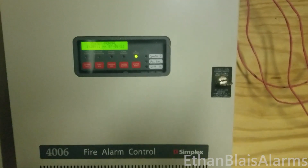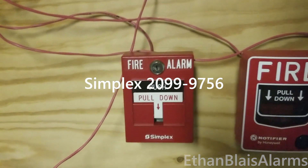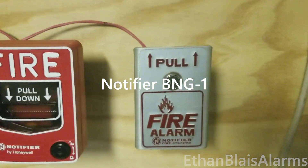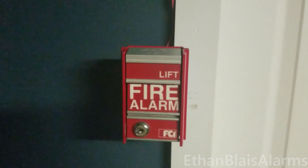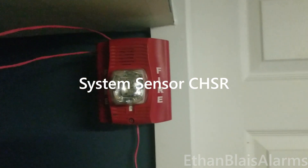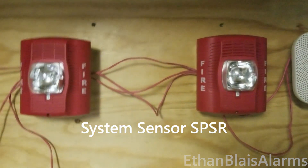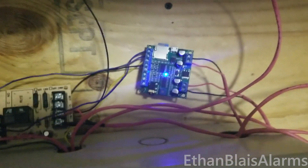In this System Test I've got a bit of a two-stage setup. For the pull stations over here I have my Simplex 2099-9756, my Notifier NBG12SL, and my Notifier BNG1. Over here by the door I have the FCI-MS2. Up here I have my System Sensor CHSR, set to single chime and 15 candela. Over here I have two SPSR speaker strobes, both set to 15 candela. Additionally above the panel I have two things: a relay and my voice module.